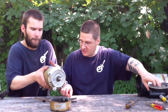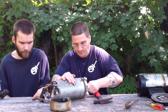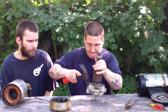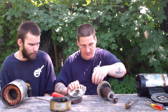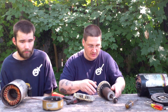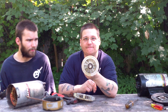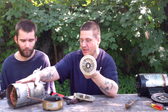All right, Robert's going to bring us the third one. What is this puppy? This is a one and a half horsepower A.O. Smith motor. We'll pull the rotor out, pull off the water sling, make sure the bolts are out of the front, and take off the front end bell. We got the water sling right there and the little bolt retainer. So the one and a half horsepower A.O. Smith motor — as me and Robert just showed you — has a 6203 bearing in the back and a 6203 bearing in the front. Once again, 6203 in the back and 6203 in the front.